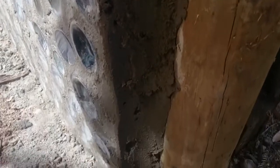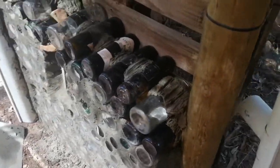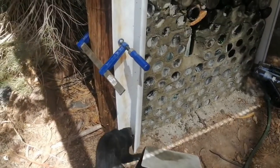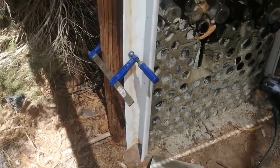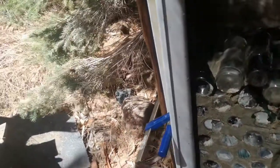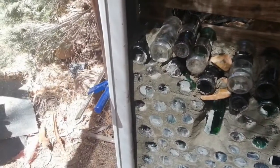The outside bottle wall is getting along quite well. I wanted to show the edge here - it was a difficult spot to work in. What we did is take an old gutter we didn't have another use for and clamped it to the pole, which gave us that edge. I filled it up from both the front and the top. The gutter is clamped to the pole and it serves as a shape just to hold the cement. I took one off after a few hours but I think I was a little hasty, so this side we're going to leave it until tomorrow.